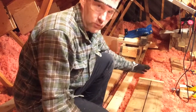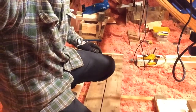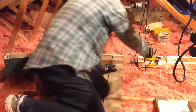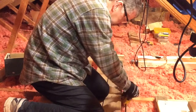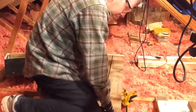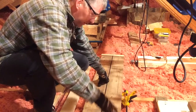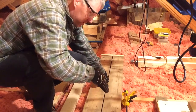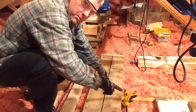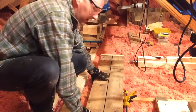Right now they're long enough to span 3 trusses. I'm going to add a quick clamp right in the middle — this is truss number 8, the truss I'm fixing. I'm going to put a quick clamp on here because the trestle that holds the jack is designed on an angle, so the force is actually going into the bottom cord members of these 3 trusses. Because it's on a bit of an angle to match the top cord, it wants to move the base sideways, so this quick clamp gives me just enough tension to keep it from sliding.